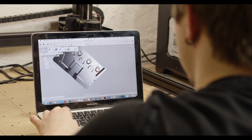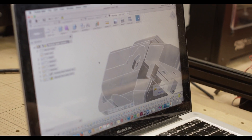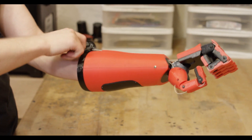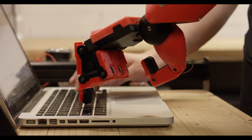This was all done in CAD, which is computer-aided drafting, so I could then print out the pieces three-dimensionally, test how they fit together, see how they worked, and figure out what I liked best before I actually started constructing the final hand. The main feature of the hand is a steady grip, but hands are made for more than just gripping objects, so as a secondary feature I incorporated a separate pull system for the index finger which can be tensioned and locked so that you have a point — more useful for applications such as pressing buttons, typing, or poking your neighbor.